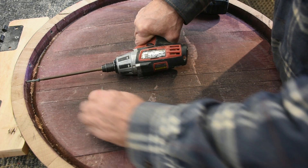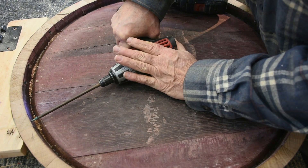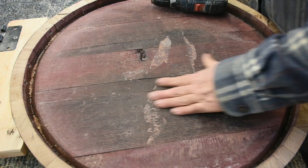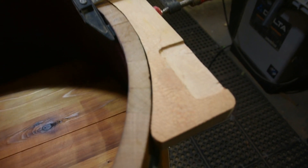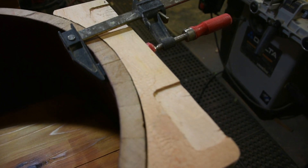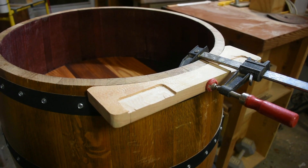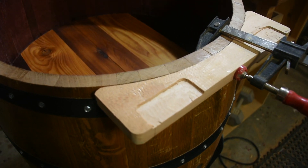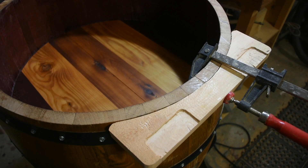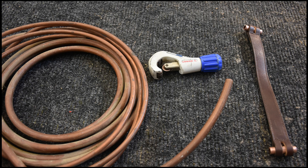Pre-drill it — you don't want the plate cracking. These lids are quite heavy so you want it secure; you don't want it to break off or snap the hinges. Here I'm mounting the back plate on the bottom, all cut out ready for the hinges. I've done the same — used hot melt glue and clamped it for a second to set. It's perfectly parallel from front to back. I used a straight edge on top of the barrel and brought the plate up flush to it so it's flat across the top. You don't want it twisted or it'll hamper the hinge from flowing freely.